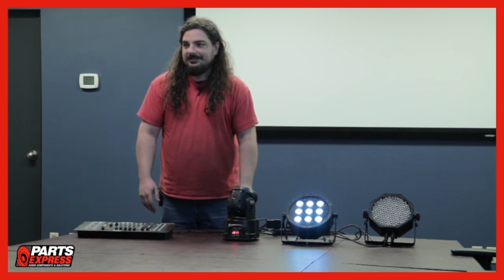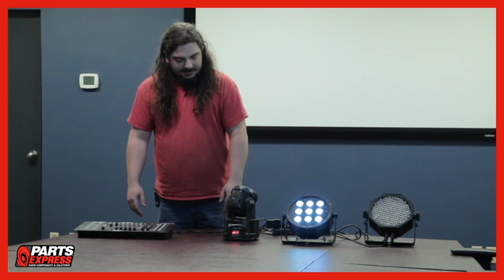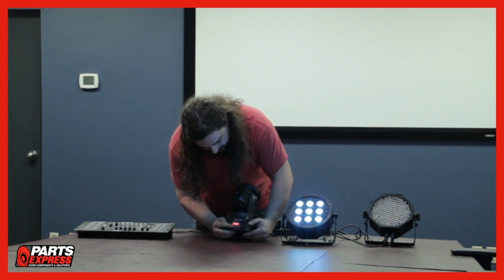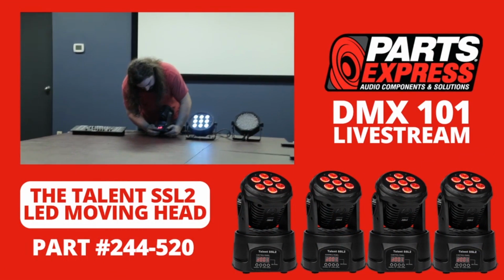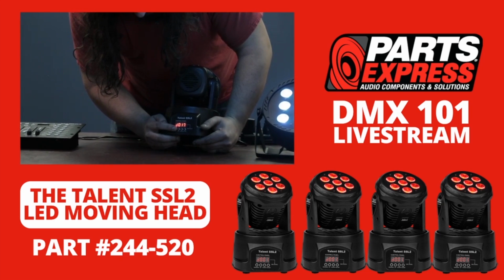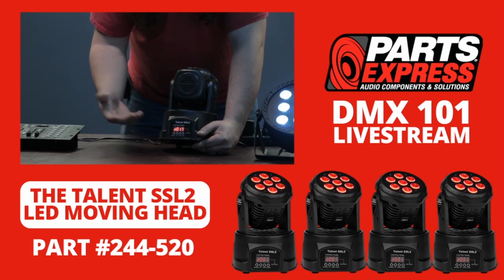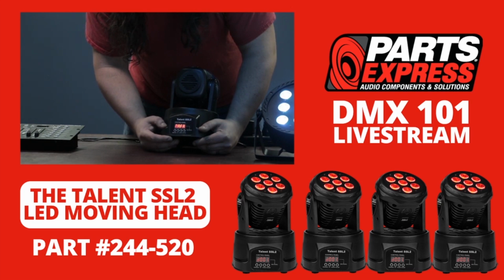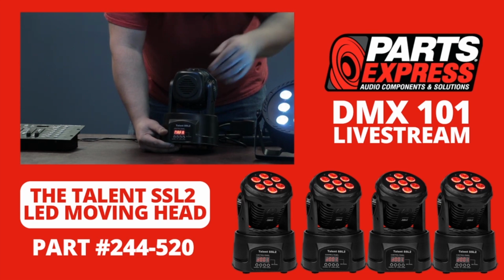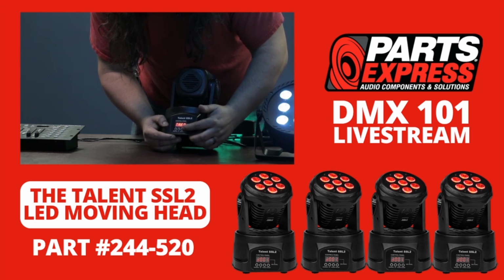Any more questions? Can you talk about the settings on the lights themselves, the buttons? Oh, well, they all have different ones. So like this one right here, I can scroll through. Let me get to the beginning. The first option normally is what starting address you want it to start at. Pretty typical. Now all of these will pretty much have an auto mode where it will work without DMX. That's built into here, and it's all dependent from light to light.